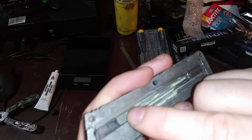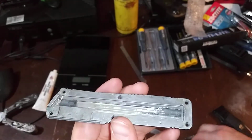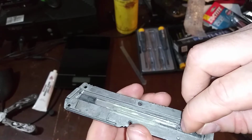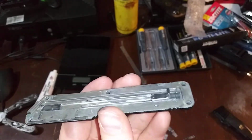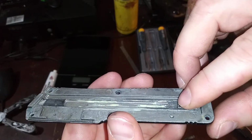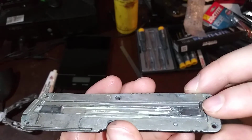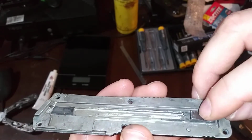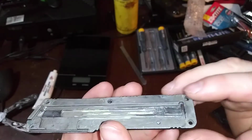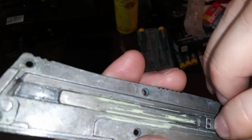Basically, the springs were allowed to exist in this channel right here where I've got lithium grease. And essentially what was happening is since I shortened it, the hook was originally something like right there. And since I shortened it, now it's back here. Now, I probably am not saying that correctly, because back here is where the hook has always wanted to be. But because I've shortened it, the holes have now traveled this way to make up for the difference. And that drags the springs into this, and there's no groove for the springs back here.